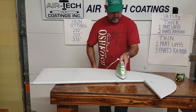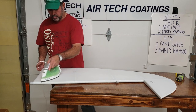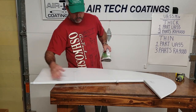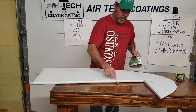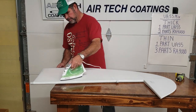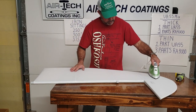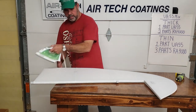There'll be a time after you put the tapes on — what I call finalizing everything, right before you go to fabric wash — that you're going to go over every little tape, every little nook. That's when you're going to really fine-line all those little places and check your corners. And we'll go over shrinking a wing.